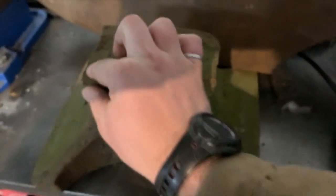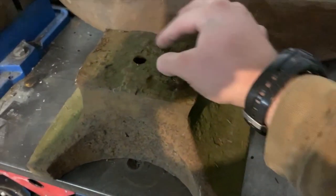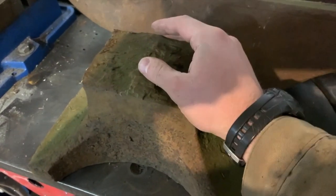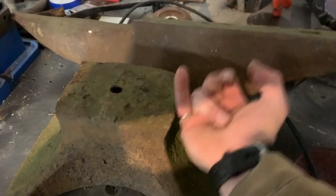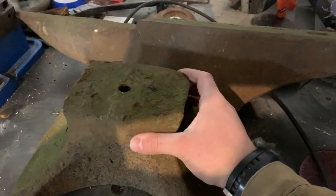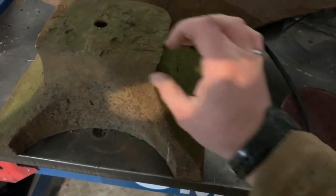You can see what we're working with. I cut a decent bevel all the way around — I probably won't go all the way; there will be a small square at the center that won't be ground down. The hole goes all the way through the bottom up into the horn, but I might thread a bolt in there to hold it while I weld it. I'll do lots of preheat and get a nice clean ground bevel all the way around, then go from there.